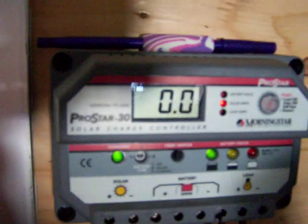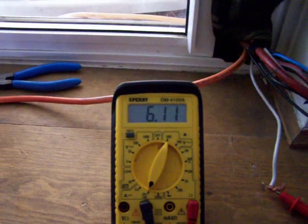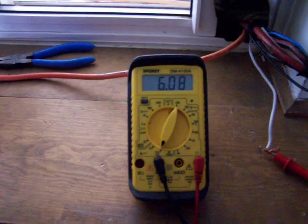I leave the turbines on the batteries all the time. You see the grid-tie inverter here — see the green light. That's the store-bought panels hooked to that right now. Now I'll throw the DIY panels on and we'll watch that green light speed up. That light speeds right up pretty good. So we got 8 amps from the store-bought, and 6.1 from the DIY solar panels.